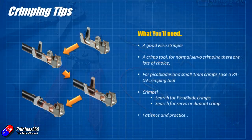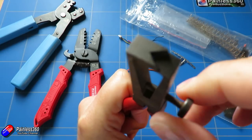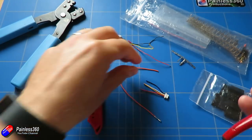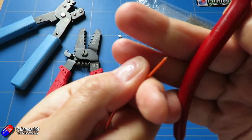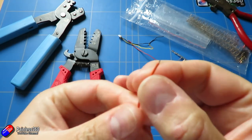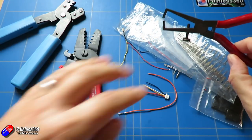So first let's talk about the tools you're going to need. You'll obviously need crimpers, but you'll also need some wire strippers. These are very old-school wire strippers — a screw adjusts the size of the hole to match the conductor inside the wire. You set the hole for the conductor size, pop the wire through until you can just see it, then pull and you've stripped the end. I always twist the wires together so none go stray — just two to three millimetres ready to put into the crimp. If you haven't got these already, get yourself a set.